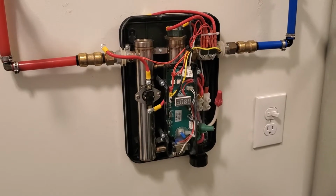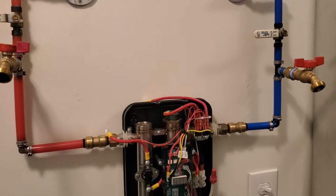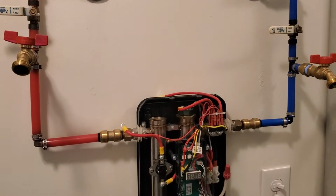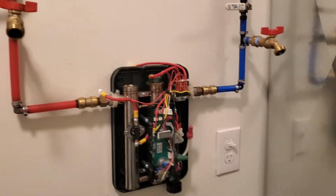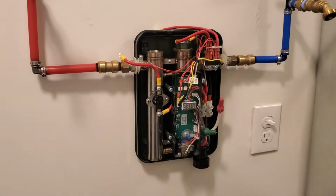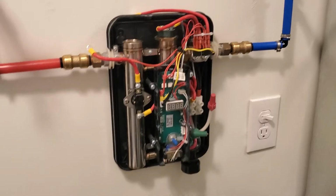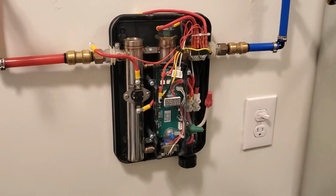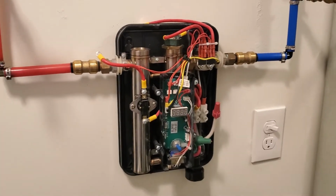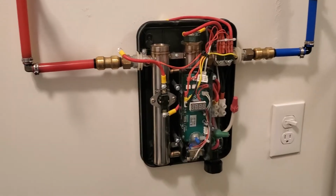So at first, I had a plumber come out, and he installed these service valves, and he flushed out the lines with a solution. So that got my pressure back, but I still wasn't getting hot water. I just had this consistent, like warm room temperature water. And I finally called up the number on the manual, the help desk, and we did some troubleshooting.